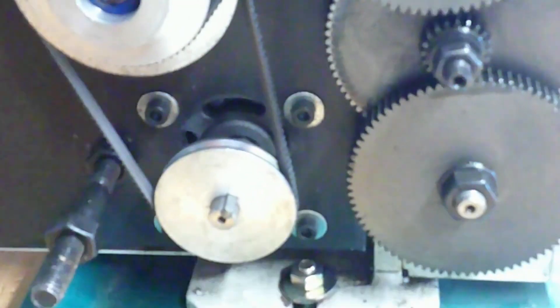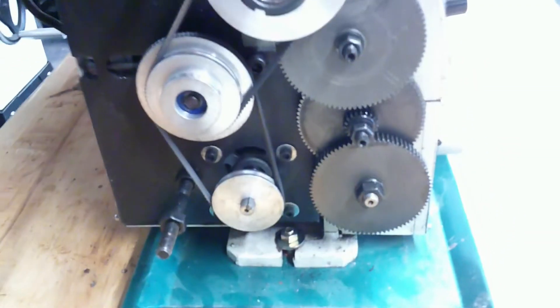I like the lathe and I got it for a good price. I know there will be some adjustments fitting accessories to the lathe and other things to do with it. One big item will be cleaning the lathe — factories use a grinding powder to wear in and seat the lathe, and unfortunately they don't get all the powder out, so it must be cleaned out. I also like the fact that it will be easier to outfit with tooling that can be made with the lathe itself. The hardware was tightened down and there's a view of the finished hardware installation on both the tailstock and headstock sides of the lathe.